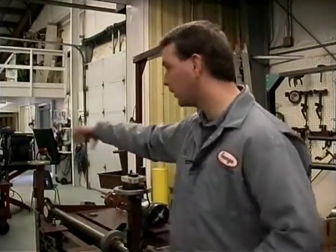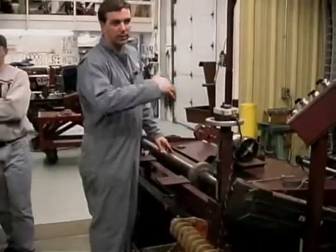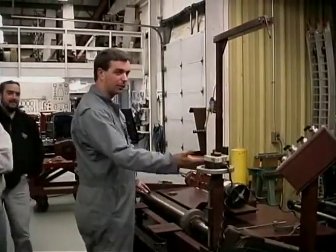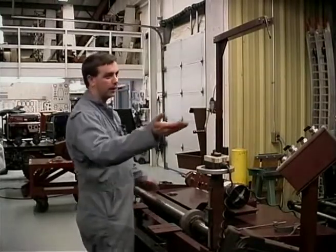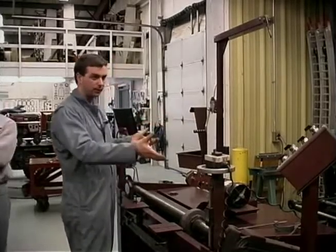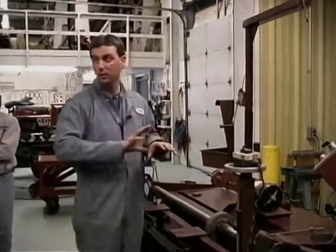So I would put it on a spin grinder like this one. If I measured that, I'd stick it on here. Which end is bigger around? In this case, it's the far end. And I would adjust the stone up on this side until it only ground on this side. And I would grind and grind and grind. And I would keep grinding. I'd slowly grind closer to the middle, and I'd check it. And I would keep grinding until I make it back into a cylinder.